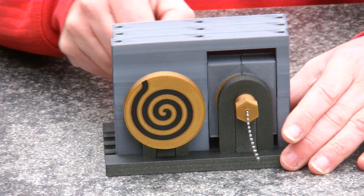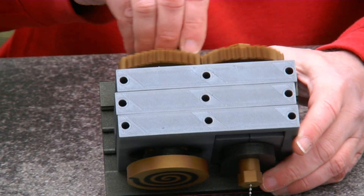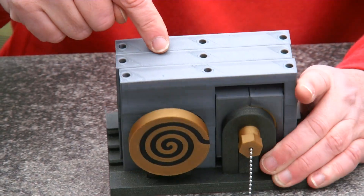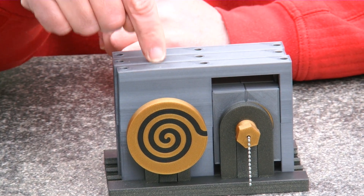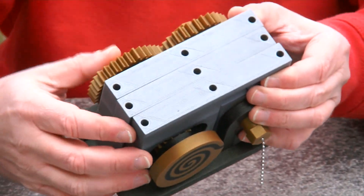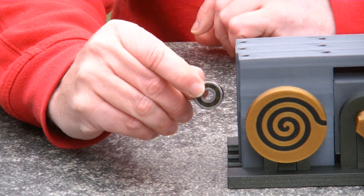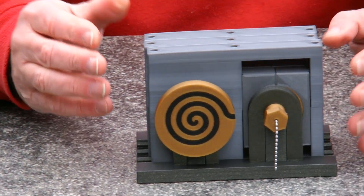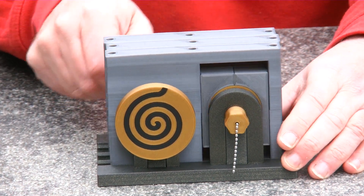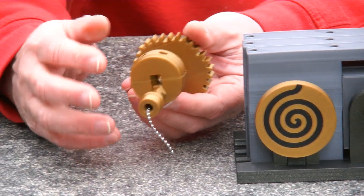And as you could already see from the mechanism, let me show you a top view — there are three pistons that are moving up and down. And what these three pistons are doing is they are pushing a set of six gears that are in here. It's almost impossible to show you, but you need to believe me that there are six gears. And those six gears have six of these bearings. So these pistons are driven by this gearing mechanism, and this is what is at the inside.